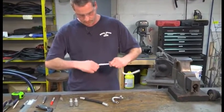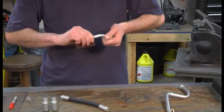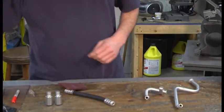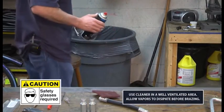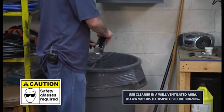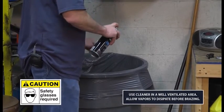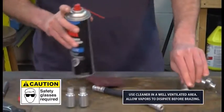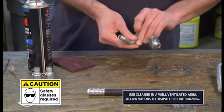Scotch-Brite works well in cleaning up the part you're going to braze. What you want to do is get your tube as clean and dry as possible — that's where your brake parts cleaner comes in handy. We're going to spray this cleaner in the fitting to ensure that we get all the refrigerant and any kind of grime, grease, or dirt out of there. Pay attention not to lose your orientation marks because you're going to need that when you go to re-crimp your new fittings.